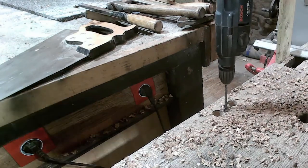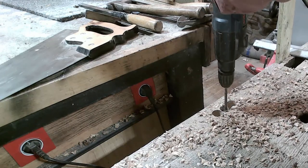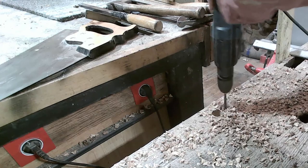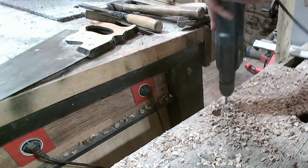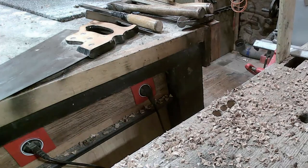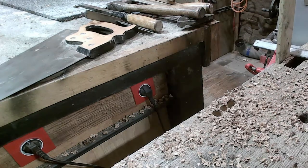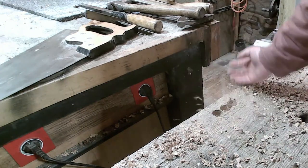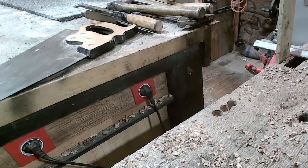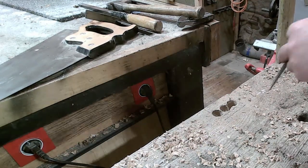How do you know if they made windows and stuff on benches like this? I'll never know. I know it would have been flatter than what it is now. In my mind, any woodwork requires a flat and level bench. Because mine, the one here, that bench is very flat. When it had a thick pine top on it, it started to get a little bit uneven. So I put furring pieces in and put another top on it, stiffened it up.